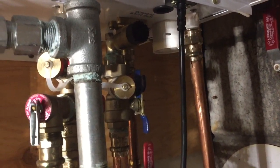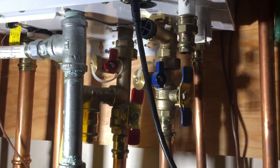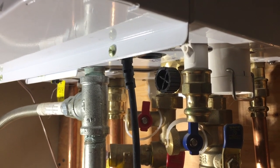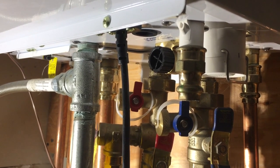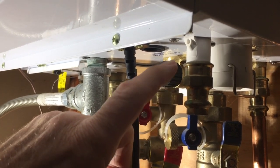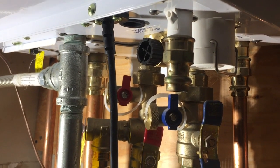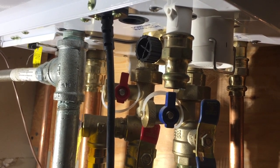This is just a condensate drain from the heater. Right. Okay, so was it sensing that it was losing pressure or something? I'm thinking maybe this was clogged and then finally it gave out, and once it started dripping freely, that's why it was going off and on. Maybe. And finally, the pipe rotted and it unclogged and the heater stayed working. Maybe what I'll do is I'll pop this off. You can turn your hot water off. Let's turn your thermostat back up, turn it up to like 80. And we'll make sure this thing condensates, because it should condensate pretty good.